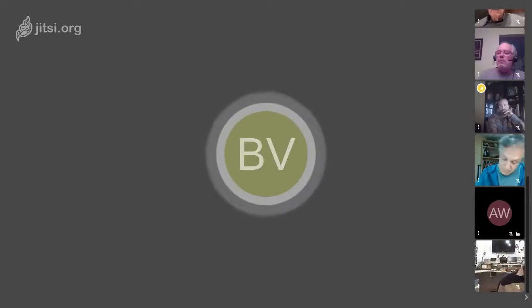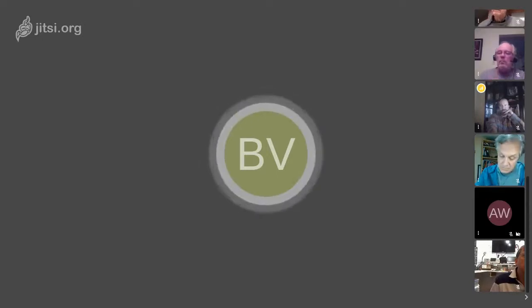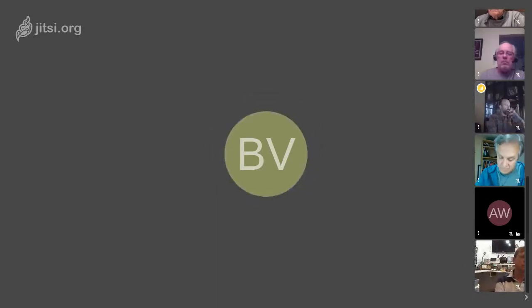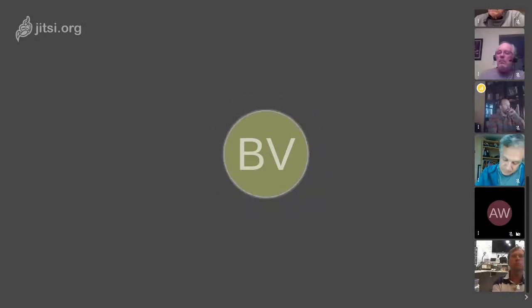So there was a few things. He changed his CW filter from electrolytic capacitors to some ceramics, taking that down from 10 microfarads to 1 microfarad to get rid of a keying thump. That still didn't get rid of it. A lot of people, the one suggestion had been to actually parallel another capacitor, I think a 10 microfarad, parallel 100 microfarad in the bottom, so you don't have to remove it. And that apparently does get rid of the thump. So that remains to be seen.